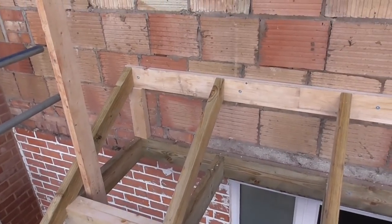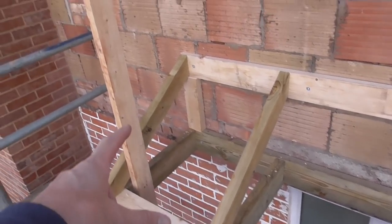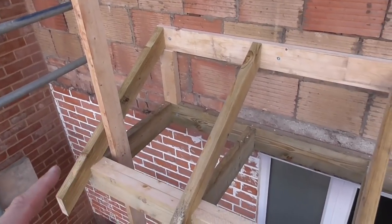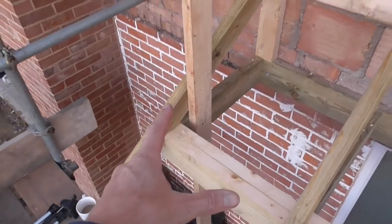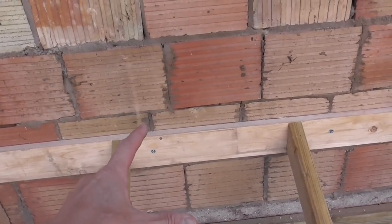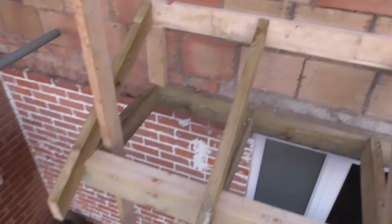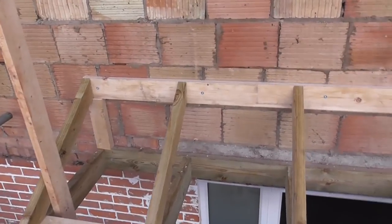So what I think I'm going to do is set the camera up and show you how I've got to unpick this rafter here, unpick that rafter there, but pretty much everything we need is here except for the hip. Once I unpick this rafter here, I can put it on the plate from that point up. It gives me a mark to cut this top plate here, and then I can fix it all back in and strike my plate, strike my hips. So let's go on with that. We'll see how we get on.